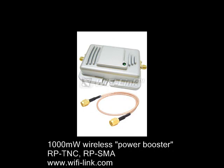One last thing I wanted to go over: what's the difference between getting this power booster and getting a larger antenna? Ideally, you want to do both, because getting a high power amplifier with a bad antenna would not be optimal. The same would be true if you were to have just your standard router with a very powerful antenna — it wouldn't propagate enough current through the antenna to actually be worthwhile. You would end up getting more loss from the cable than anything. If you happen to get a combination of both, your signal will be less susceptible to interference.